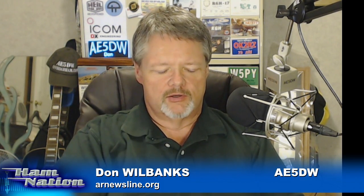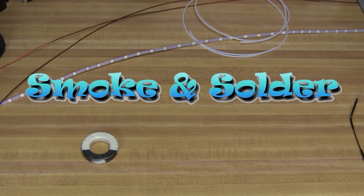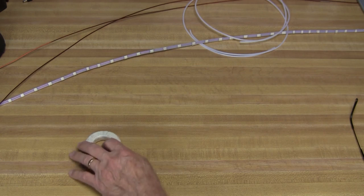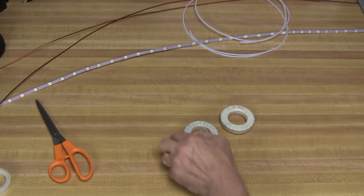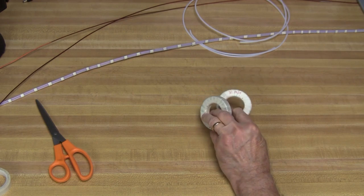George Thomas has a lot of solder and he's going to be doing field day. For the last couple of weeks we've been talking about baluns. Last week we built a one-to-one balun. This week we're going to build a four-to-one — it's a very similar construction process but with a few differences. We're using essentially the same materials for the four-to-one balun with a couple of additions. First, we're using two toroids — still 2.4-inch ones, number 31 mix this time around.